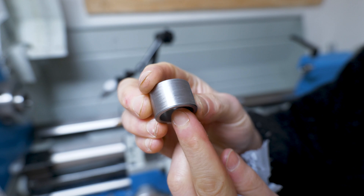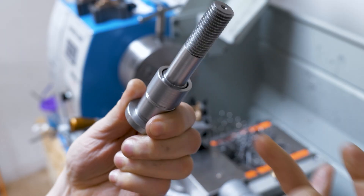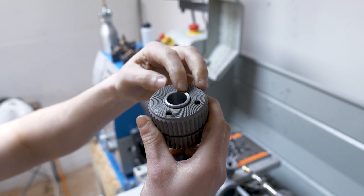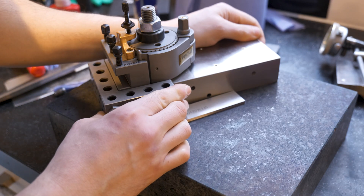It's not the best finish, but I was able to get it cut at least — the carbide tooling worked very nicely and we've got a nice fit on the post. Now it's time to start thinking about fitting the Multifix to the compound and getting the hole drilled for the dowel pin.